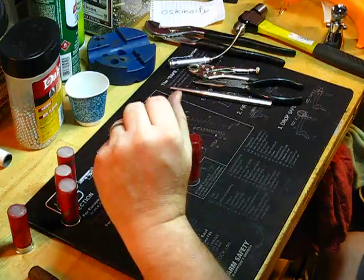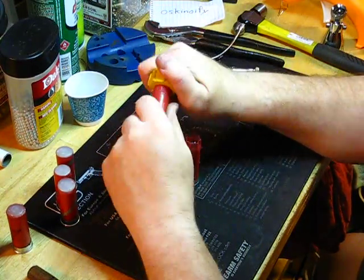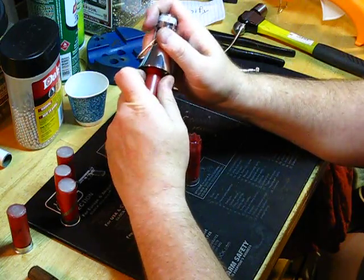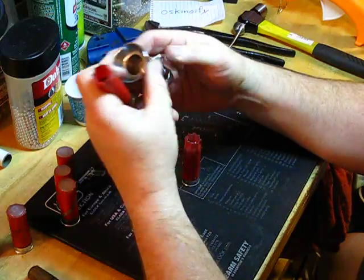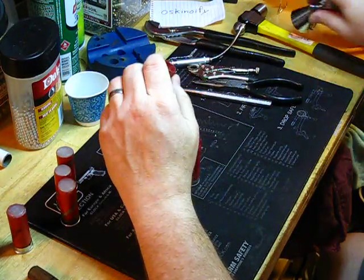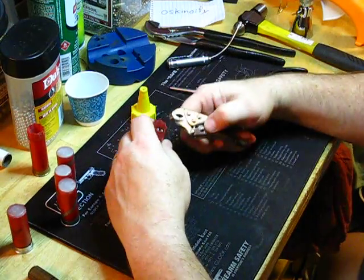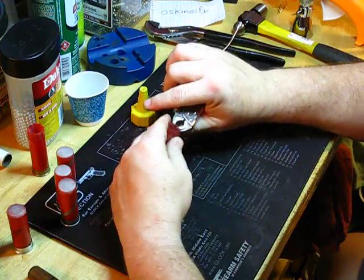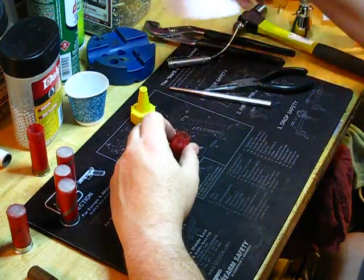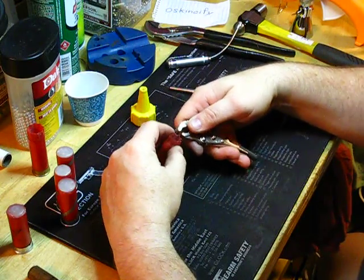This thing here is just a little spigot nozzle. I found it has to be the right size to round the shells out if you get a deformed shell. And then I found this other thing — this is for the opposite, to close it down. This just happens to be the exact diameter of a shotgun shell; it's some old shower head. You might be able to make something out of pipe or machine it yourself. I also found this is useful for closing the crimp because I had a really hard time with that. So you've got it full of BBs — you want to kind of pre-crimp it and then once you put the BBs in, re-crimp it again, because you want to simulate that original factory crimp.